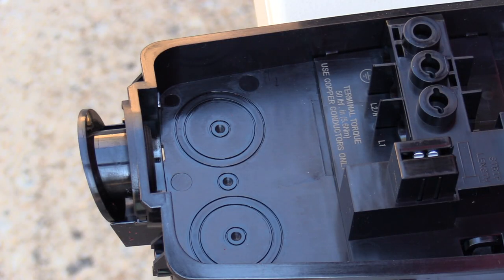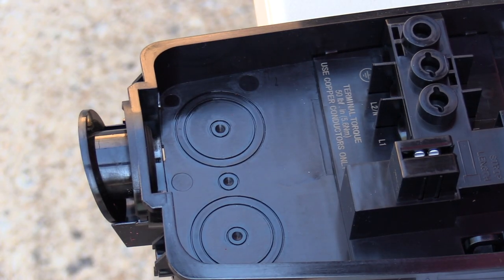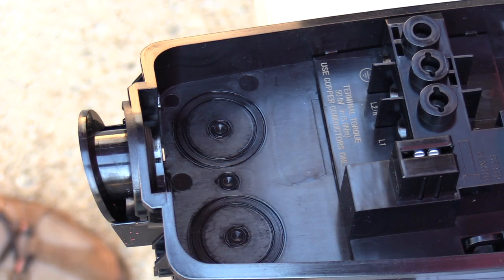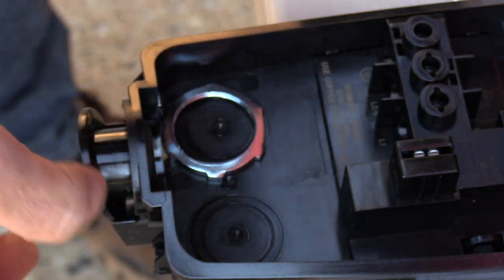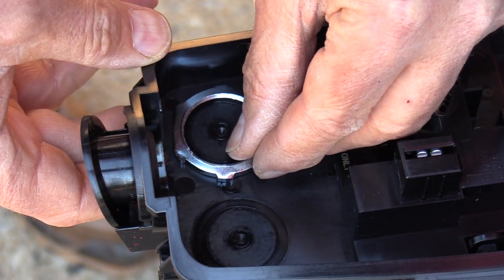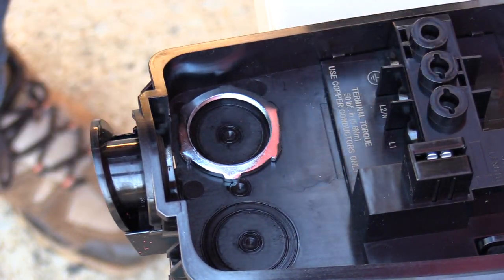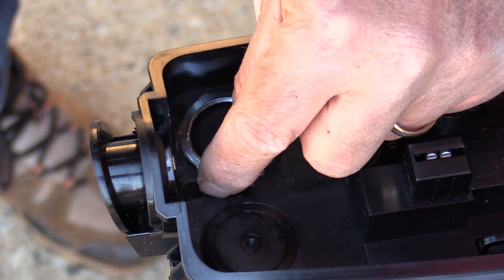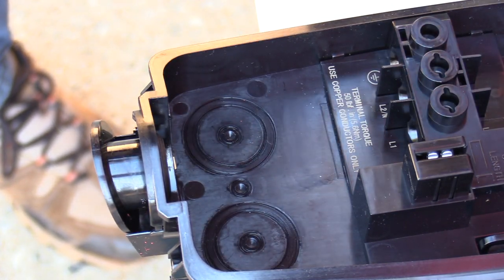The wall plate has two conduit access points, one on each side. I favor the left side because it falls between studs. Notice the back of the cover is actually waterproof — they only want you to drill the holes you need, to keep the minimum amount of penetrations and keep moisture out of the inside. Before drilling, it's really important to fit-test the connector and make sure there's enough clearance for the nut to rotate inside. It actually fits fine and there's enough clearance to rotate the nut.